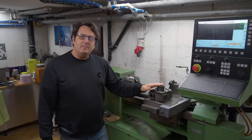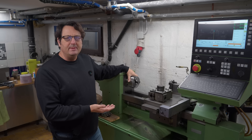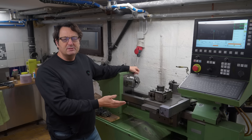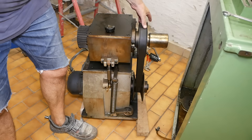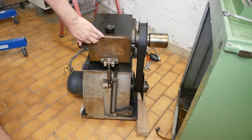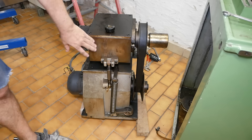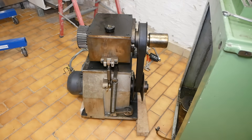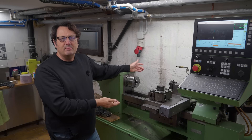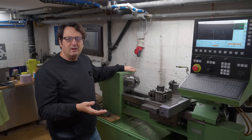The resistor has this advantage. My spindle drive system on this lathe is pretty complex - in fact overly complicated most would say - because I start off with a three-phase motor controlled by a variable frequency drive, and then that power goes through an infinitely variable mechanical drive, a variator, to get to a back gear where you can nominally select between a one-to-one speed ratio or a speed reduction of one to seven, and then from there it's got a big wide tooth belt up to the spindle. The advantage of that system is that it was already in there, so I didn't have to change anything mechanical other than putting the variable frequency drive on it.